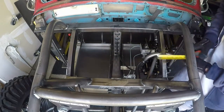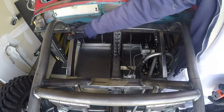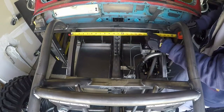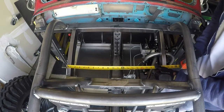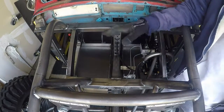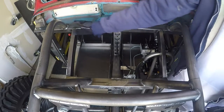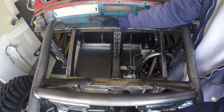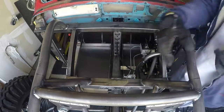One thing that I'm gonna do, I'm gonna start with this as my straight edge, okay? I know that this will be straight. With this, this is roughly 21¾ inches wide, and that's pretty consistent. However, I laid these out, I welded these. I'm not 100% sure if this is gonna be a perfect 90. So what I'm gonna do, I'm gonna cut this piece, starting flat here, I'm gonna go a little bit too long this way, and I'm going to go a little bit too wide this way.